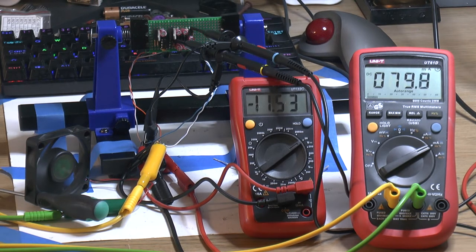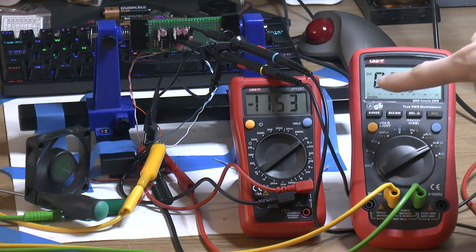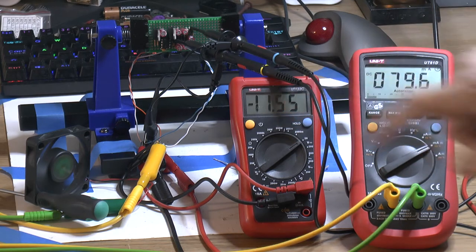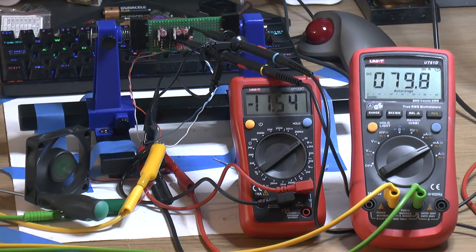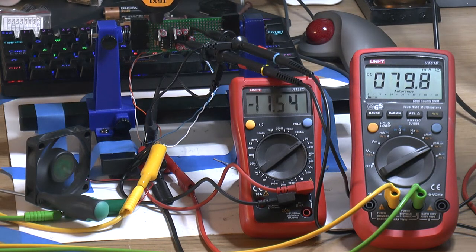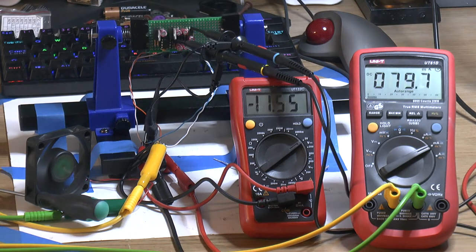I also had some problems with my fan that I used as a heavy load. It draws about 80 milliamps and we have minus 11.55 volts. We're drawing right now 420 milliamps from the power supply at 12 volts, so I have from my estimate about a 23% efficiency. Right now these transistors are at about 105 degrees C.